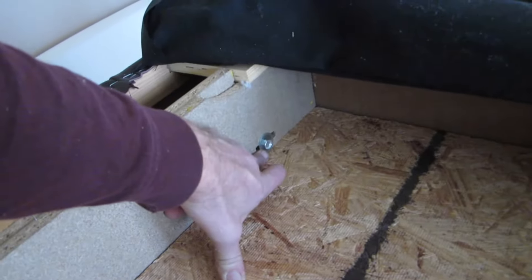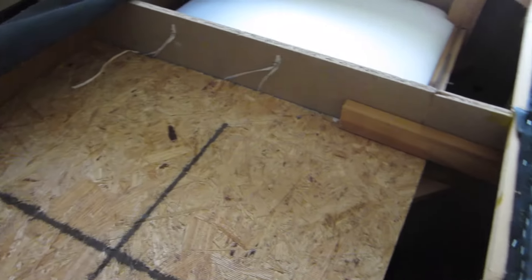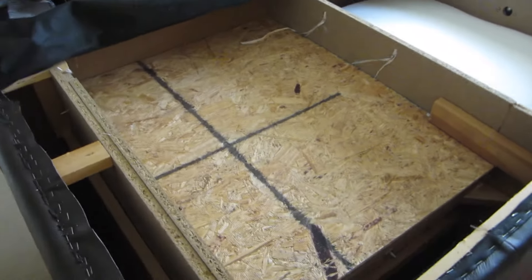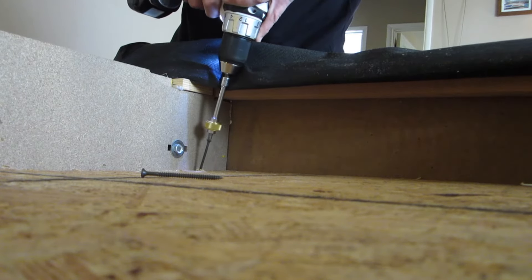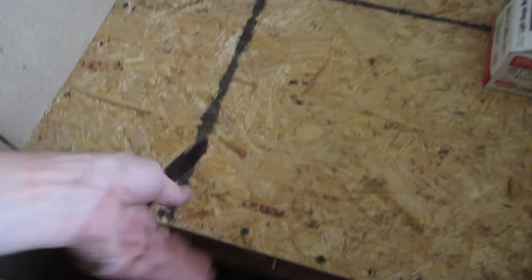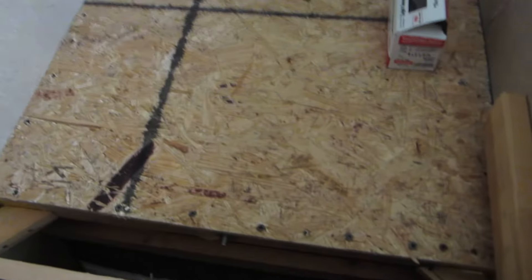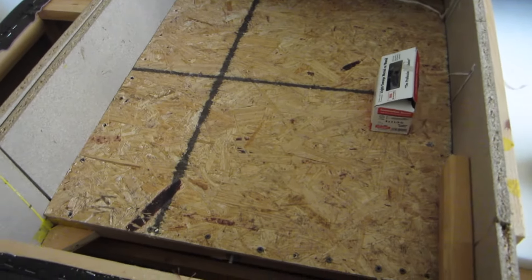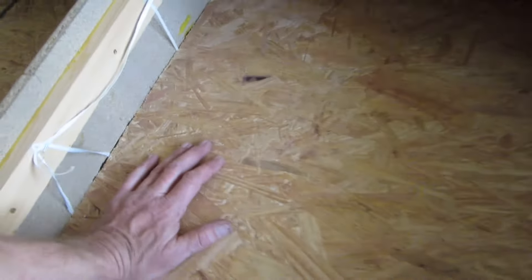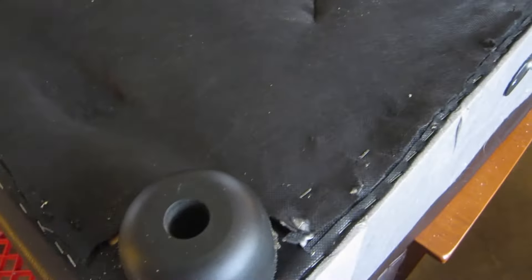That fit almost perfect, but it's now pressed up by the foam. I had to take one screw out — I could have notched the board but I just took the screw out and replaced it. Now we're going to start some screws around the perimeter and work this thing down to compress that foam. I've gone around and cinched everything tight. You don't want to leave stuff hanging from the screws — you want it pinched tight or it's going to creak and eventually fatigue your fasteners. All the perimeter is tacked down with about 20 screws. Second side is cinched up and looks pretty good.